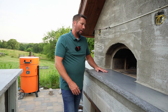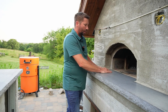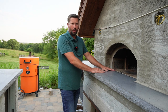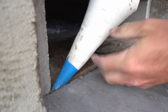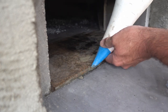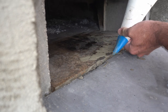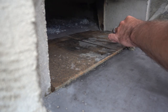Once the slab was in place, you need to take care of the gaps — mainly the gap between the landing and the fire brick. For this I used the same standard mortar, two-and-a-half parts to one part type N. It doesn't get hot enough to worry about using refractory — standard mortar will work. I tried to pipe it in with a grout bag and, as you can see, it did not work well. It made a mess all over the place. I'd never used a grout bag before — I'm guessing the mix wasn't wet enough, but the water ended up coming out the top.